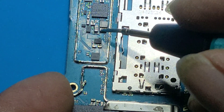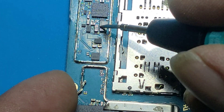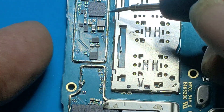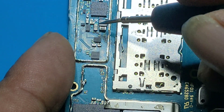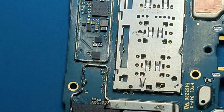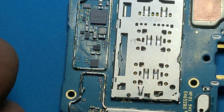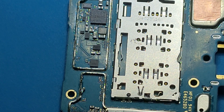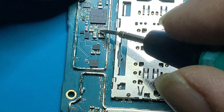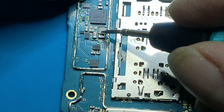You should remember that when a pin connects to more capacitors, it is the VDD pin. The other pin is for charging. We don't have the schematic diagram for the Oppo circuit or any circuit, but we can identify the VDD by this pin.